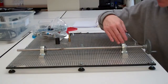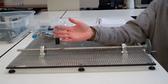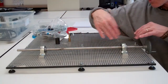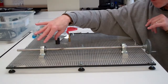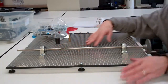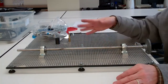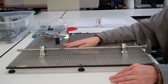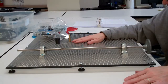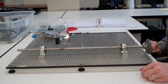Because we're going to use this setup again next week for a belt, don't have the shaft crooked on the board. Make sure the shaft is lined up straight across. It's easy to check — there are so many holes drilled in the board that you can step back, look down along the shaft, and by eyeing the holes you can see whether the shaft is square. Try to get it as parallel to the top edge as possible, perpendicular to the side edges.